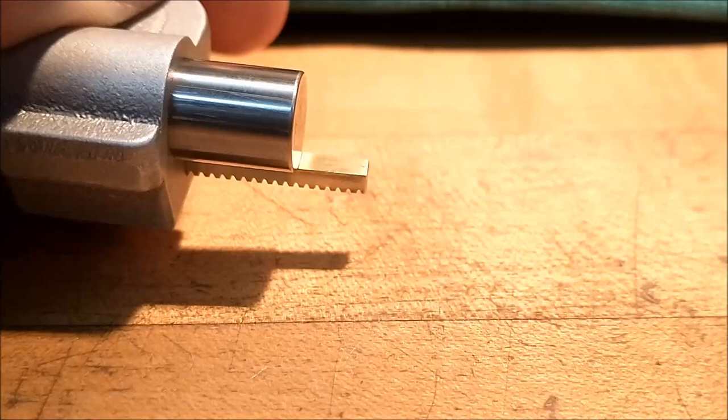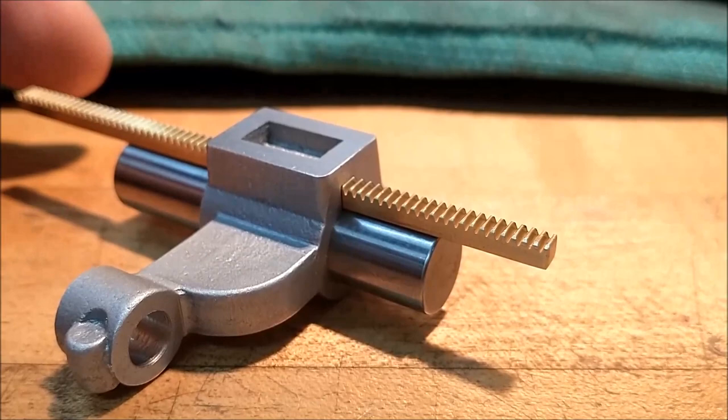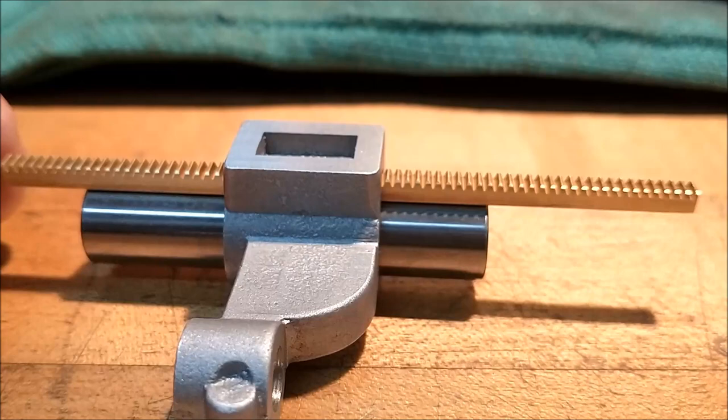If there's any break edge in your tool as you slot this, you may think that the groove is too small when it's actually not. What a nice free fit like this with the proper gauge pin in place. Now we can move on to the pocketing, the screw holes, and the fun stuff.